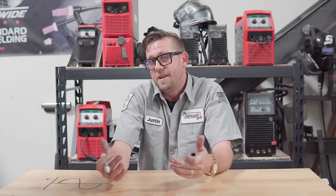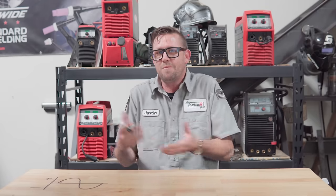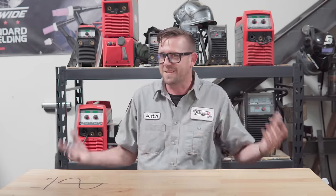A little history: back in the day, if you were an AC TIG welder — someone who could weld aluminum — you were the top dog, the greatest of all great welders. It's not that aluminum was all that difficult, it's just that what we were given to weld it with was relatively primitive. Basically, we were working with what came straight out of the wall. Here in North America, that was a 60-hertz sine wave at 50-50 balance — that was the extent of our control.